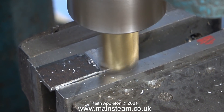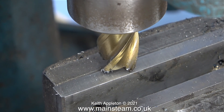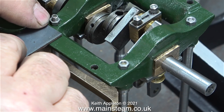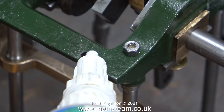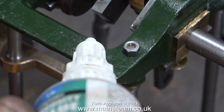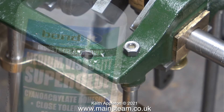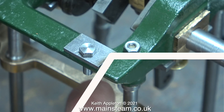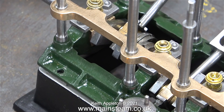Over now to the milling machine - I'm milling a piece of steel to exactly the right thickness to make a pad to fit onto the casting where the single bolt goes through into the base. I previously made one for the center bolt on the other side. This metal pad needs to be exactly the same thickness as the casting pump mounting is from the bottom of the base. I mark the part with a marker pen, cut it on the bandsaw, drill a hole in the middle, and now it's time to mount it to the underside of the sole plate in precisely the right position. For this I'm using some medium viscosity cyanoacrylate adhesive - superglue. After applying the adhesive I stick the metal plate in place and put a bolt through it to ensure it's in exactly the right position. Once the superglue had cured I removed the bolt.